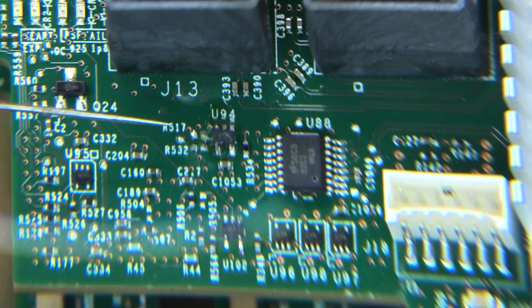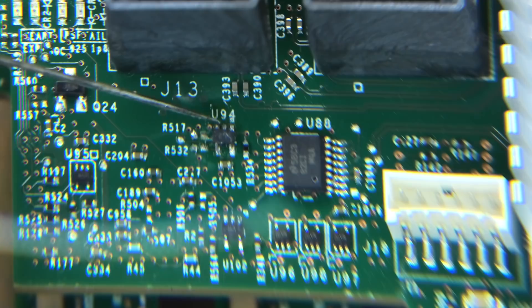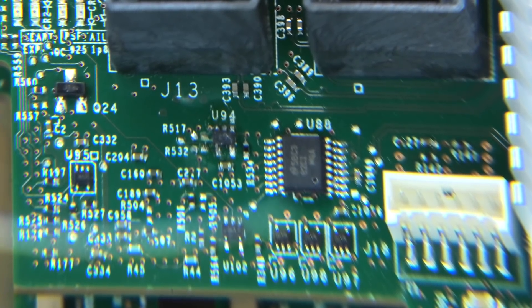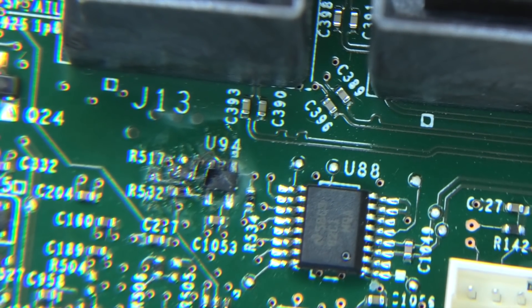Just to make this repair even more crazy — that pad right there has broken off. There's a tiny lead that goes under that component I just soldered on. By measuring with a couple of needles I found that pin goes to the middle connector of this one. So I need to connect this lead here to this resistor over here when it's mounted. Yeah, that's not gonna be any trouble whatsoever...